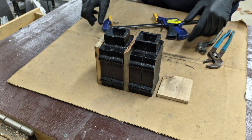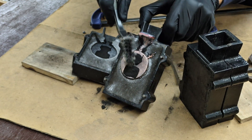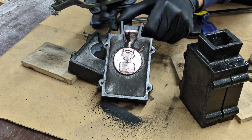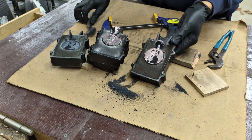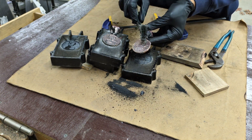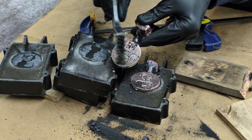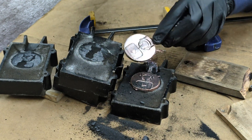Now we're in the garage — it is a day later and I'm going to be opening up the other flasks to see how those ones came out. These ones are actually my channel coins, or channel rounds as some call them. I don't think I've ever made them in copper — I have a bunch in aluminum, but I really don't think I have one made of copper. But now I have two. After removing these from the sand and cleaning off all the green sand stuck to the copper, I'm going to bring them over to the vise and cut off the sprues.